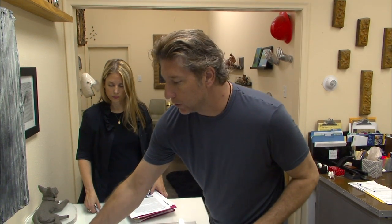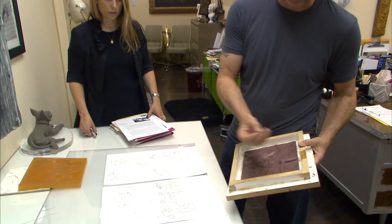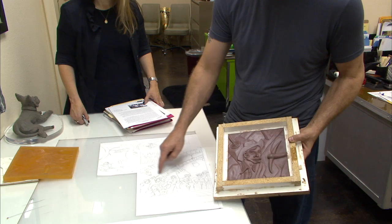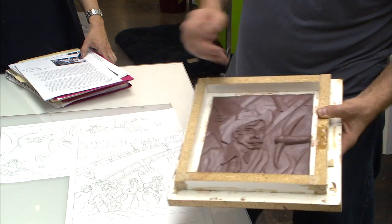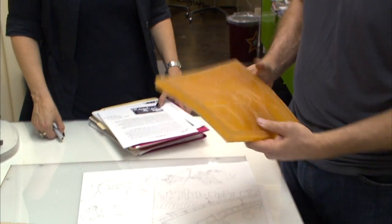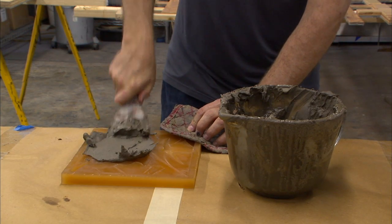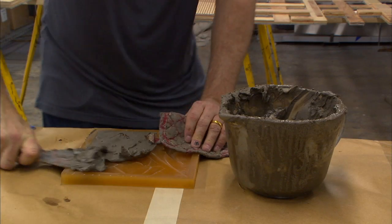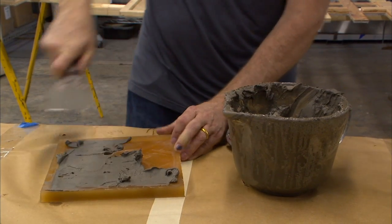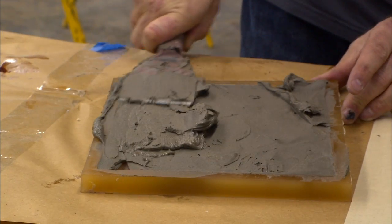What happens is we take a soft, squishy clay and we've sculpted this little quadrant, blown it up to give us the style. From there a mold would be made — this is a mold of that piece — and then we can use the lost wax casting process to generate a wax, which would then be cast in bronze, welded and put back together. In the end, a final patina would be put onto it.